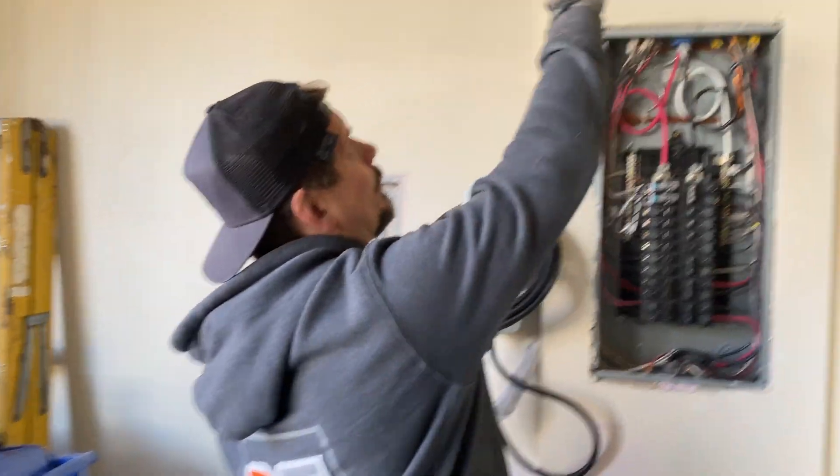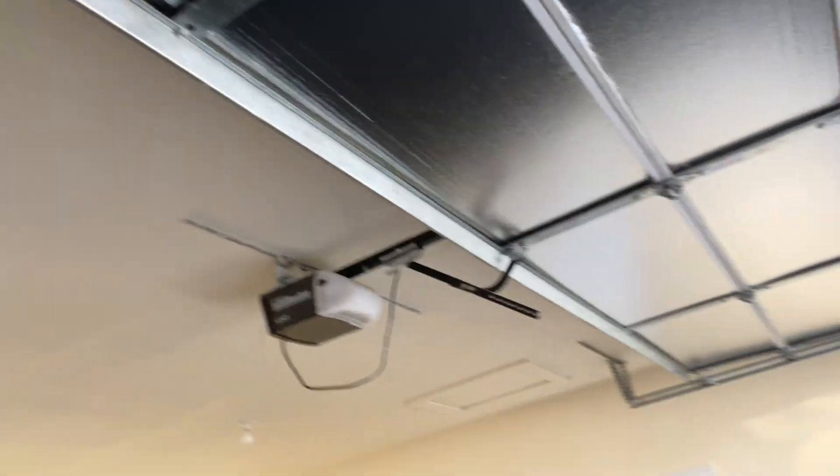You also have to keep in mind if your house style is a ranch — sometimes it's easier to go up the wall with a piece of flex across the attic and back down. But if it's going to be a two-story, then you have to put flex on the driveway or conduit. The other thing to keep in mind: closer to the panel, always cheaper.